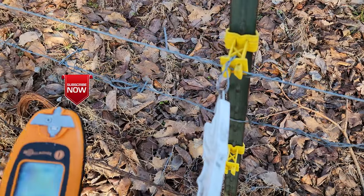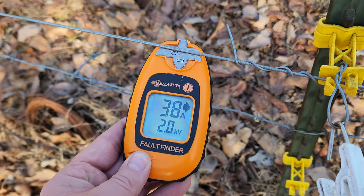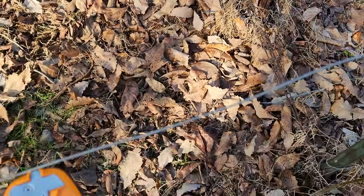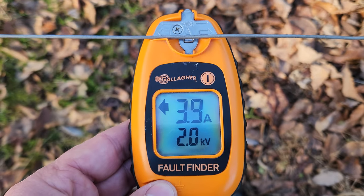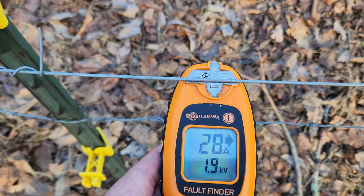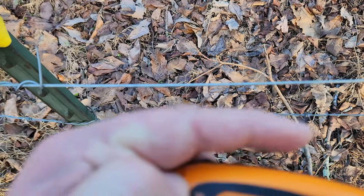So I'm here at a junction in the fence and I'll test it on this side. We've got two kilovolts and it's showing 38 amps, so that means there's definitely something shorting it out. We've got this fence that tees off and it's only showing 4 amps, so there is a little bit of an issue that way. But when we come to the other side, we can see it's still showing 28 amps of draw — definitely an issue down this way up the fence.